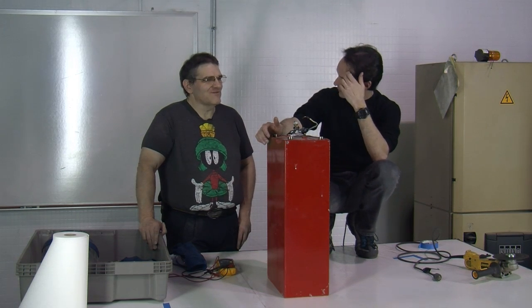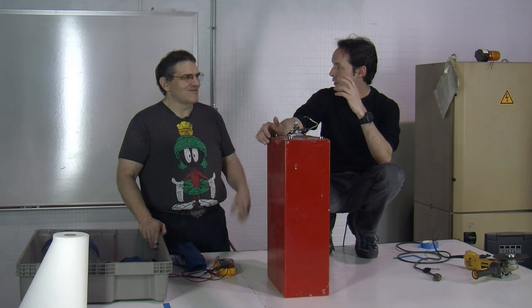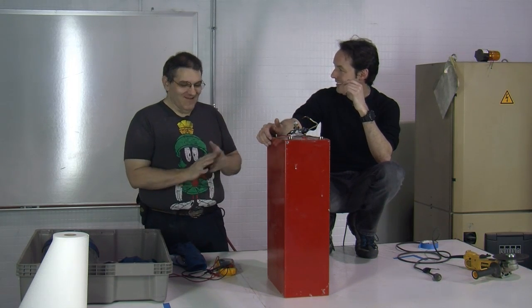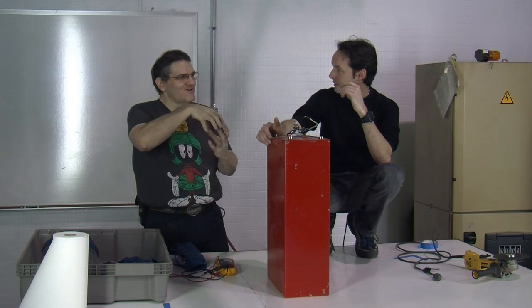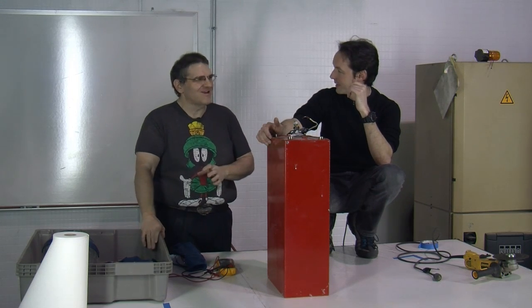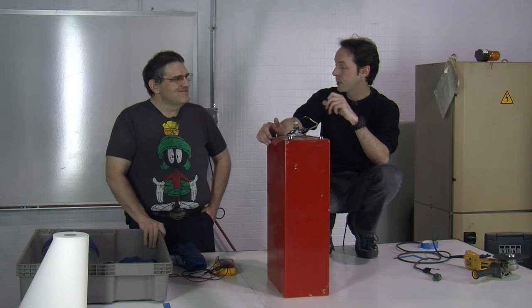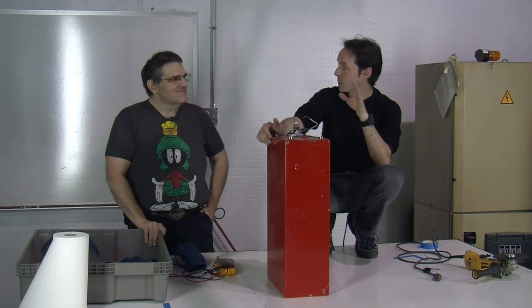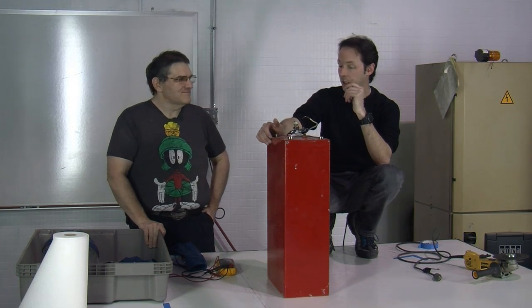And it only rings a couple of times because the primary coil, the work coil around the coin, vaporizes into plasma and goes from like 10 turns of wire to one turn of plasma in the blink of an eye. There are staggering things going on right there. A lot of people have been writing in asking if we can do a video on the whole process of quarter shrinking and the details of that. We really should do that soon.